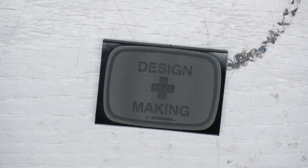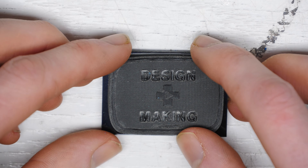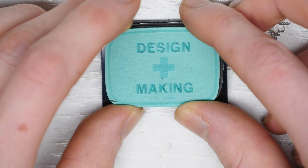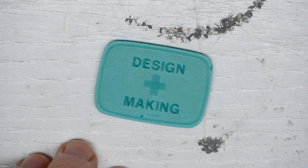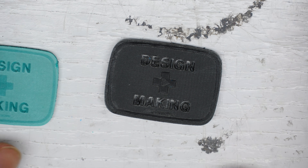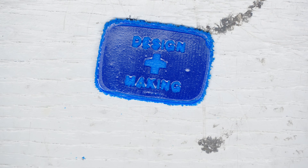Let's try something a little more decorative. Let's cut out one of the Design and Making logos — this has some cutting and some etching. That looks all right. Here's one that's cut out on the outline. You can see the jaggedness of the laser; it's not really smooth. Here's a piece of green acrylic — dark green — and that's what you get when you laser etch it: it makes it sort of light green. Here's a blue one — that's a blue failure because it's a blue diode laser, so you can't cut blue material.